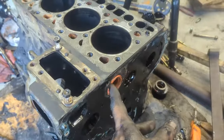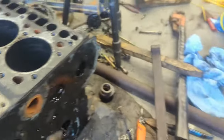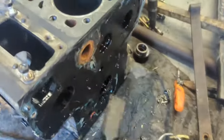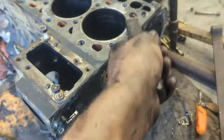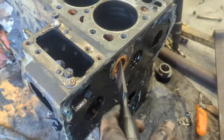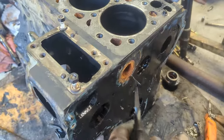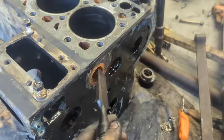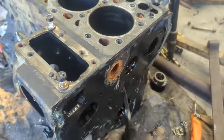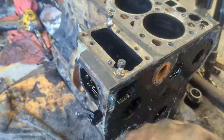One thing I suggest before you take it to the mechanic is to take out all these seals, all these O-rings, all these gaskets. Using one of these scrapers, pull out all these gaskets and crud off the top. They're either way gonna redo it. The reason I suggest doing all that is because they're gonna wash the engine block, and what they use is sodium hydroxide, a lye, to clean it. All this paper and O-rings and stuff will prevent the lye from doing its thing.